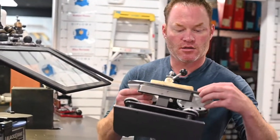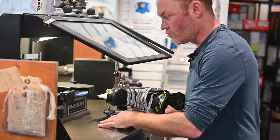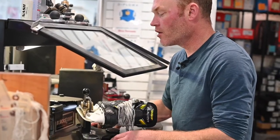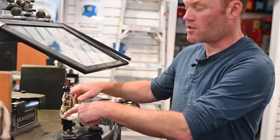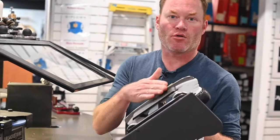A lot of the times you'll see tons of blade burned off on the front and tons of blade burned off on the back. That's because guys will go really slow when they first start, then they zip really fast through the middle, and then they go really slow on the way out. When you go slow in different spots and fast in others, you're burning different amounts of steel - burning more on the toe and heel, less through the middle.